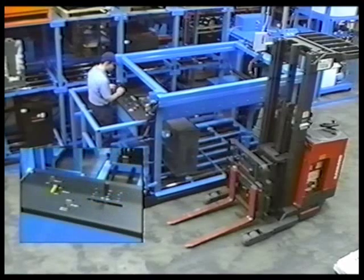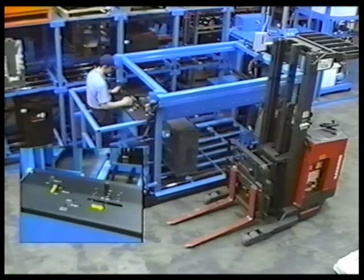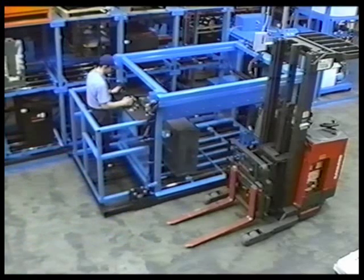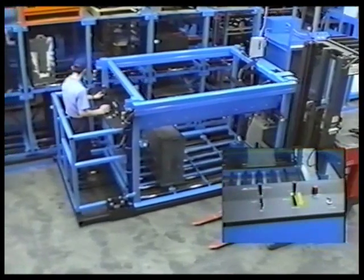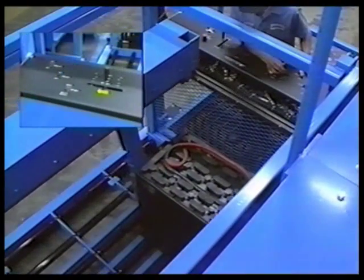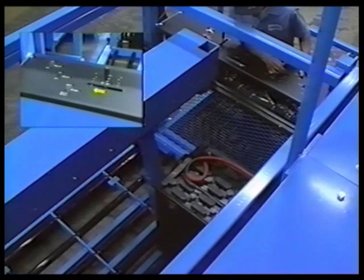The magnet rotate switch is turned on and the bridge joystick is moved to the right. This turns the power face of the magnet 180 degrees and prepares the magnet to push the spent battery into the rack. The operator then uses the travel joystick to align the spent battery on the roller bed with the appropriate storage slot. Moving the bridge to the left, the operator pushes the battery into the storage slot.